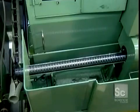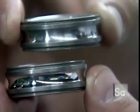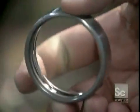Now the rings go for polishing. An abrasive stone lubricated with oil polishes the steel surface until you can see a reflection — here's the before and after. Next stop is washing: they coat the rings with thick oil and a fine stone grit, then clean the raceways with kerosene.